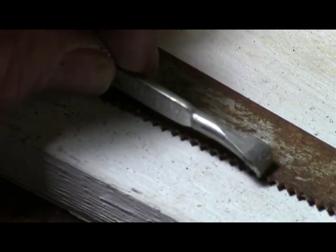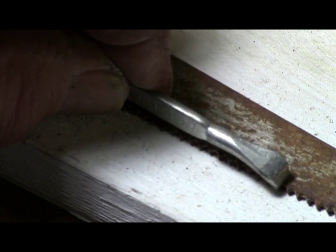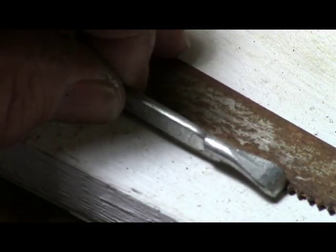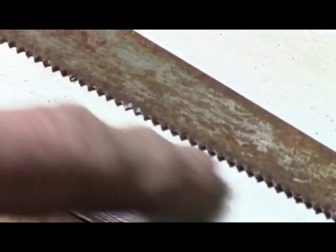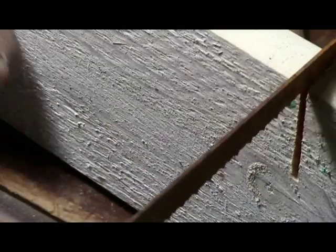Now this is a whole lot easier than using a punch, because with a punch, you have to line it up, and then of course you got to use two or three fingers to steady it. This, you can just lay it there, and it pretty much holds itself. But you have to make sure you're on top of the tooth, and you just do that all the way down until you get the set that you want. That's the reason you do that, so that you can have that space in there